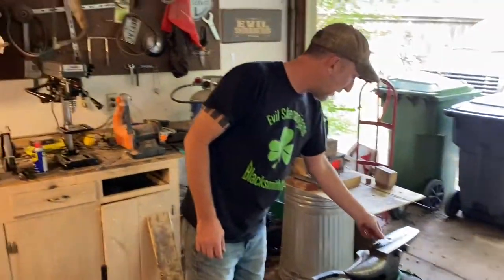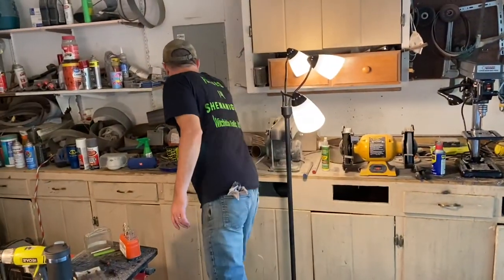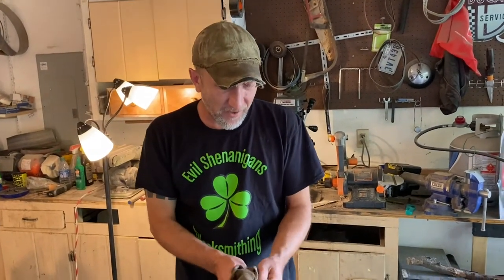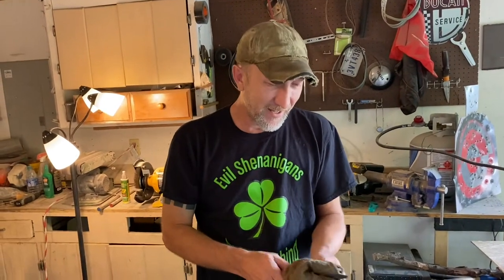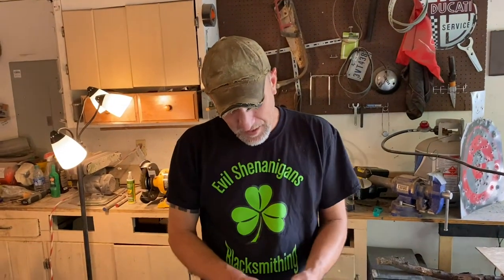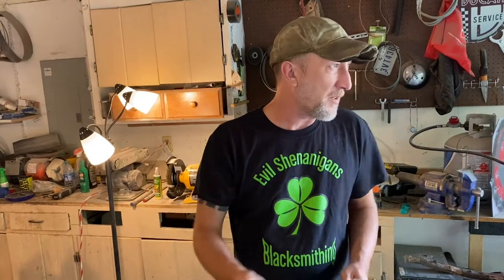I have to admit I was a little concerned about that knife - it was awful thin. I get carried away with the grinder. The kitchen knife I made for our buddy Rick, which was like my fourth knife - when I quenched that thing it came out warped enough you could peel watermelons with it. That was a learning experience. I was able to straighten it out though - I had to do another round of thermal cycle and quench it, then shim it in the temper to keep it straight. The biggest issue was I ground it too thin and it had some spots thinner than others, which caused it to pull to that side.